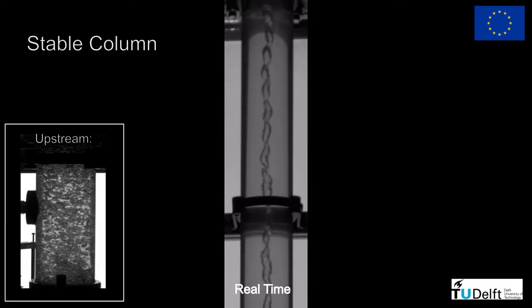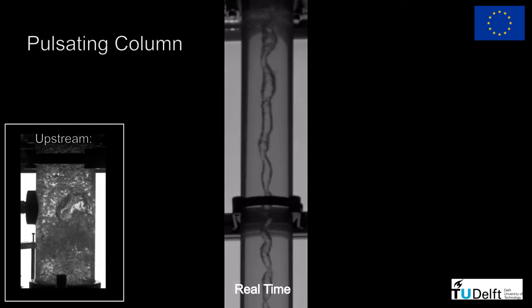A stable core is formed for upstream bubbly flows. In this pattern, the oscillations in the core interface are small, and the pickup tube valve can be adjusted relatively slow for an optimal separation. When the airflow rate is increased, the upstream flow is no longer a uniform bubbly flow, and the core starts to pulsate. The pulsations happen when the large bubbles cross the SWIRL element. A fast response of the pickup tube valve would be required to capture the pulses that propagate in the core.